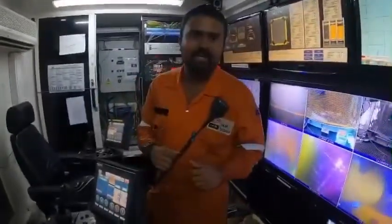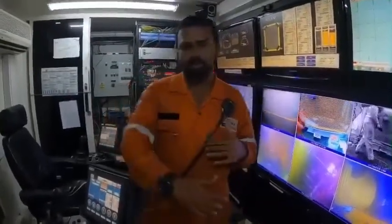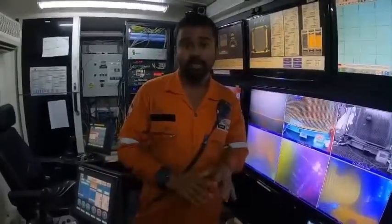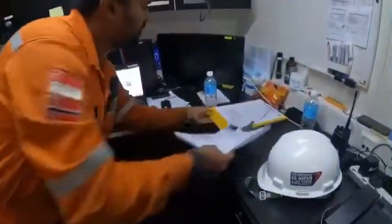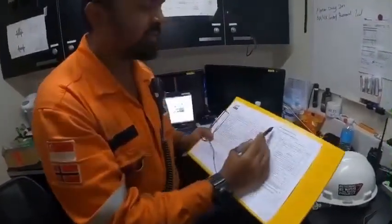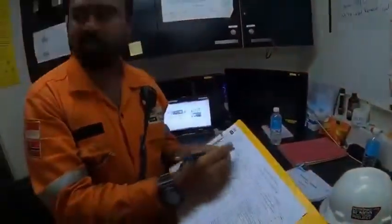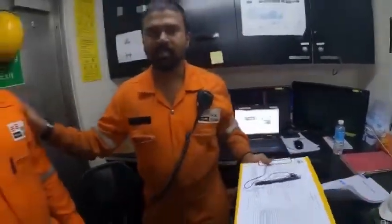Now we're going to commence a deck check. We do a deck check every time before we launch the ROV and also after we recover the ROV, just to make sure the ROV is in good condition prior to going to the subsea and after coming up. We have a checklist here. Every time the sub-engineer or pilot on deck does a deck check, they fill out a pre and post-dive checklist, note any remarks, and confirm the system is up and running. This is our lead supervisor on this operation.